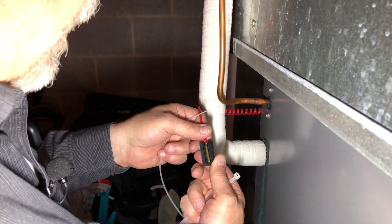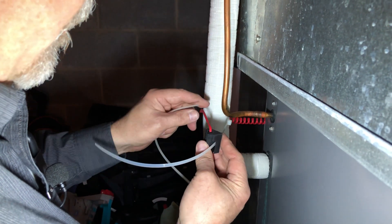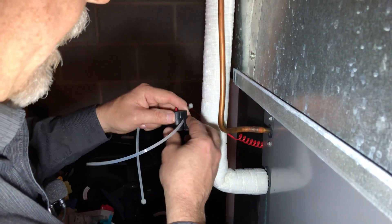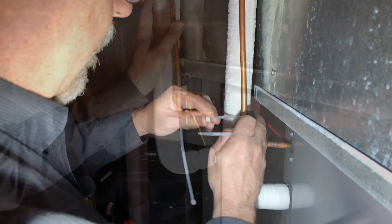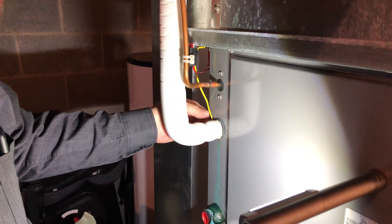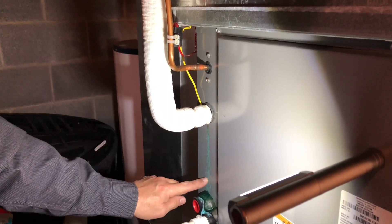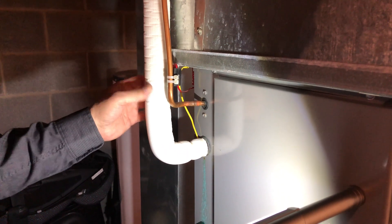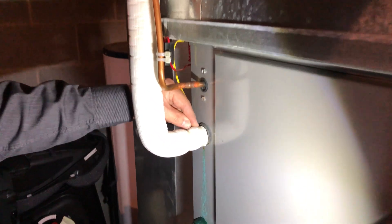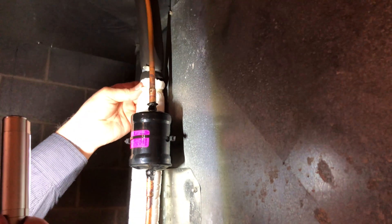There's a small piece for the liquid line sensor that slides into the block. I put the zip tie up and through this face-up so the wire is locked in and not going to fall down, then route it around behind and clip it to the liquid line — just zip tie this snug. The liquid line sensor and suction line sensor are now attached. The suction line sensor goes up underneath the Armaflex and gets wire-tied down so it's snug. Down here you can notice she was getting some water staining from condensate dripping onto the coil — the Armaflex is a little loose on the copper. We zip-tied it down to seal it off tight, same thing up high. A wire tie to seal that off on the black Armaflex will stop that condensation from dripping down. While doing Sensi Predict, keep an eye on these types of things.